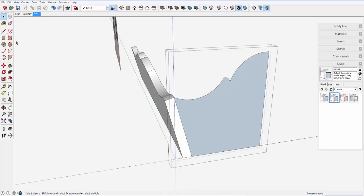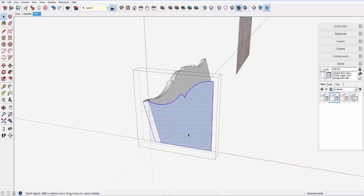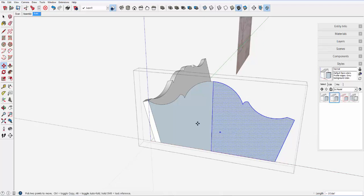Now, coming to the end group, it also needs an extension to provide material for the dovetails that I'll add later in the corner connection. So I've added three-eighths of material and deleted the extra edge. Again, we have a half-symmetrical shape. Copy that half, flip it, and bring it back into connection at the center, then delete the center line.